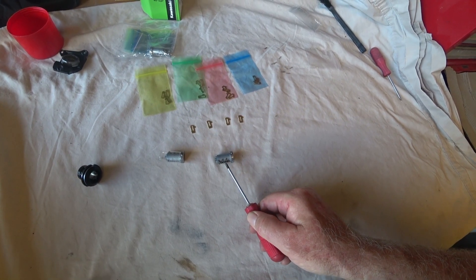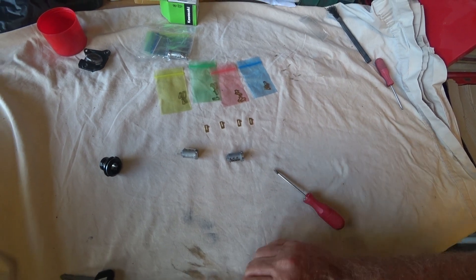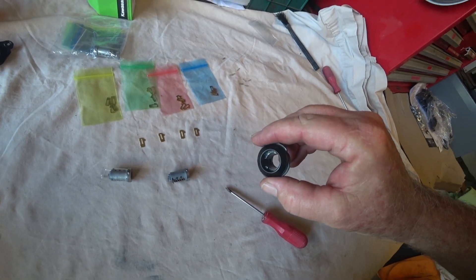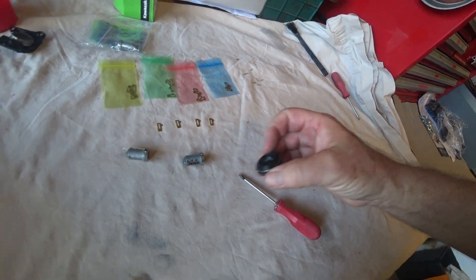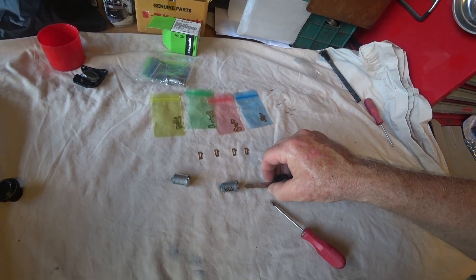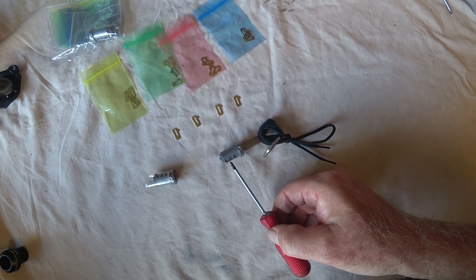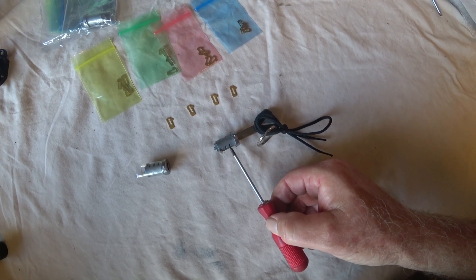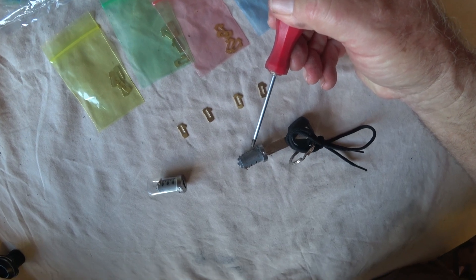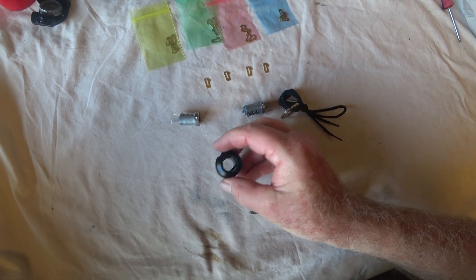See these little things that stick out — don't know what they're called, sliders, wafers, something or other. They stick out and they stop you turning the key. In here, they go in that slot, and on the other side there's another slot. So when they jam into that slot, you can't turn. So you put the key in, and what's meant to happen is — a bit tricky to see — what was sticking out now isn't. That one lines up perfectly with the outer so it'll turn. This one is a little bit underneath, and you can see it's sticking out the back. This one and this one are sticking out slightly. So they jam in this slot, and therefore the lock won't work.